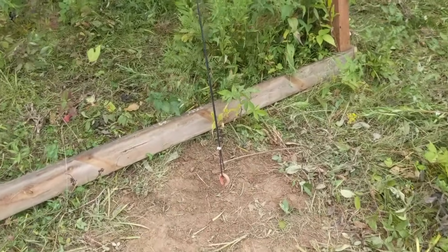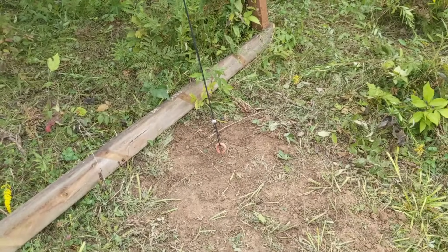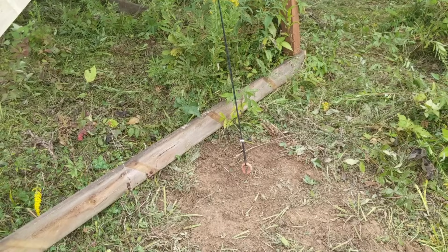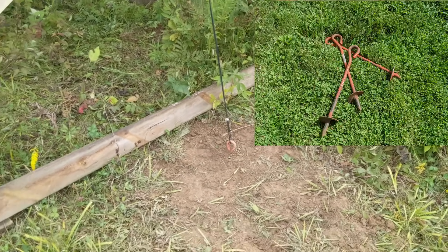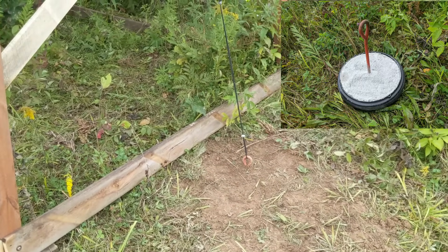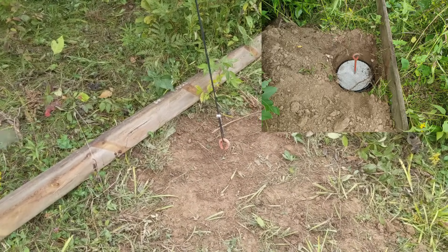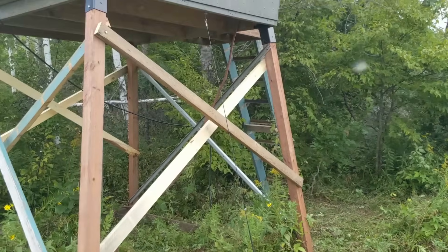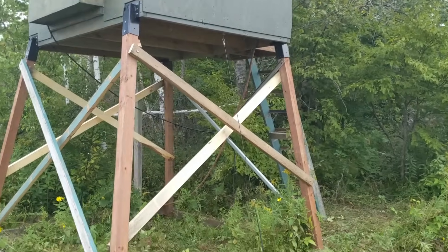These are mobile home anchors. I got four or five of those for free — I've had them for several years, maybe five years. They were 16 or 18-inchers, and I wasn't quite comfortable with how long they were. So I poured a circle of concrete around the base, dug a 16-inch hole and buried them in there so there's a lot more pulling resistance if we get a strong wind. I had a couple box blinds go down last summer in a windstorm with 100-plus-mile-an-hour winds, and I don't want that to happen again.